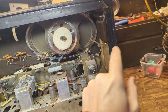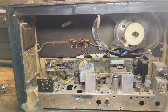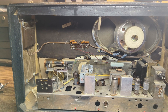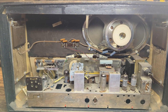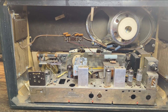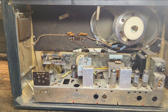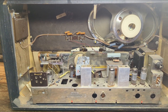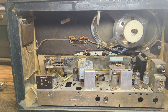Including the eye-tube, it's a seven-tube set. The rectifier is solid state, so technically it's an eight-tube equivalent radio. What's interesting is that in Germany you were taxed on the number of tubes your set had, so a lot of times tubes would have multiple sections — two to three sections each — so you could get the performance of a higher tube count set at a lower tax rate.